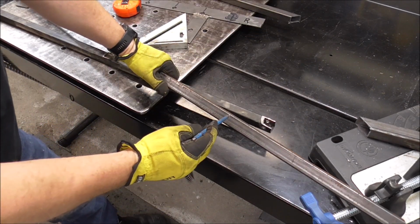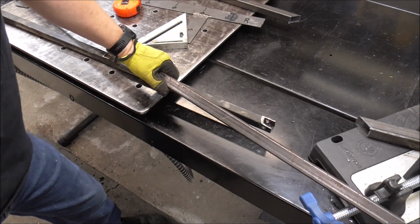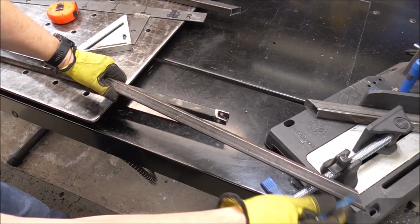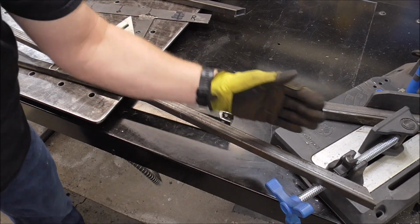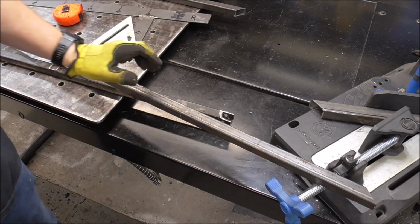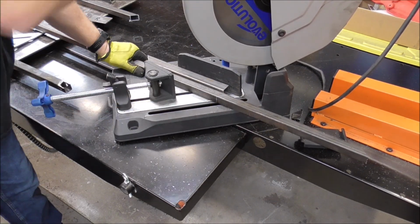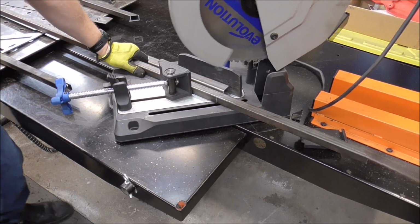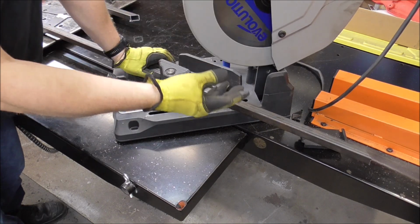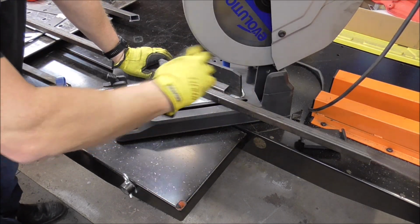So now you can see that that picture frame angle is the opposite of the other side angle. So that way, that way. The saw doesn't bevel both ways, it only bevels one, so you've got to carry this line around. So that's the best way that I found of dealing with angles like that with this saw. Just makes it real simple, fairly quick. That way you're not spinning material from this side to this side and flopping it left and right.